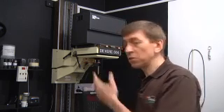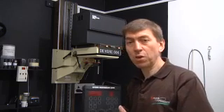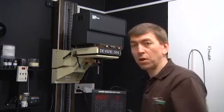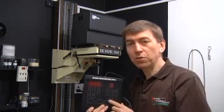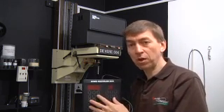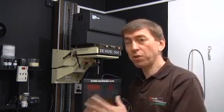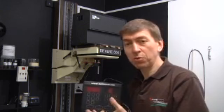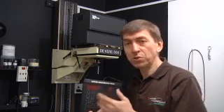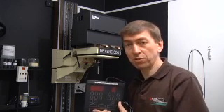Having acquired this enlarger, I designed a special version of the analyzer to control the two light sources in a slightly different way to how Ilford does it. Ilford basically changes the power level of the two light bulbs and runs both together for the full duration of the exposure. My system runs the light bulbs at full power but changes the time each is on to alter the contrast of the paper.